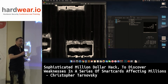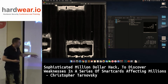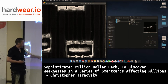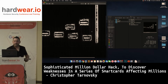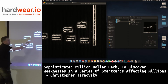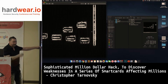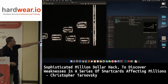So, metal will light up. Black is absorbing the beam current. So black is charging when you're in the machine. Then in the middle of the box, I knew the wire was right there. And I knew the wire was right there because if you look, here's my alignment right here. So in between 2 shield lines, I dug a hole deep. I dug through that metal that's blocking, through the metal plate, and then I got to the wires. And then here's all my wires I'm after.